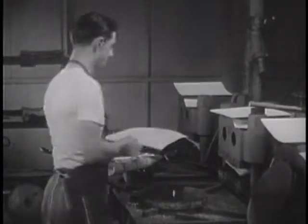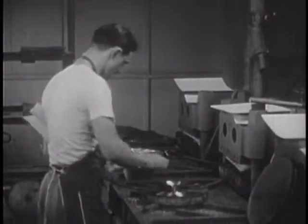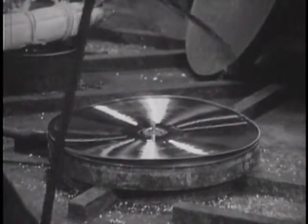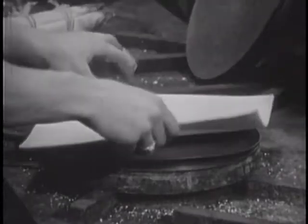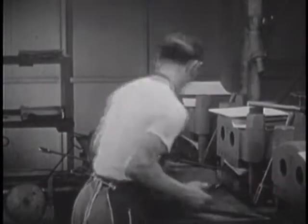For still greater strength, the completed matrix is soldered to a rigid backing. For perfect contact with the hot backing, the stamper is heated with flame, protected with a chemically neutral blanket, and pressed evenly into the hot solder.